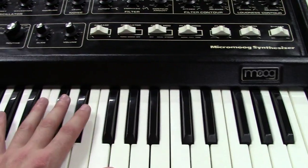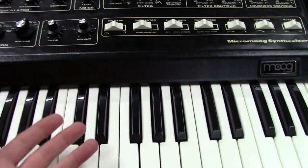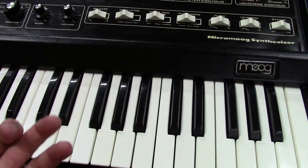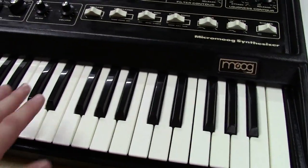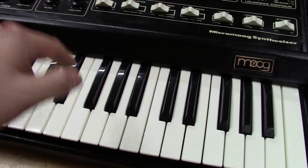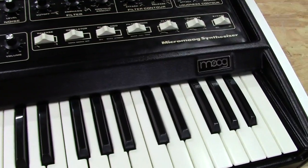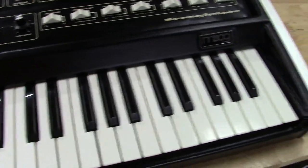And so this one has a later circuit board, where they used a fiberglass circuit board, and it lays vertically underneath the keyboard, and it has integrated circuits making up the resistor network. So it's a resistor package, and there are these chips, so it saves a lot of room. But also your J wires mount differently. They mount to the circuit board and stick out from underneath, which gives you more of an angle when you push, so it's under less stress. And it doesn't have the sliding motion as much as the earlier styles inside the actuator arm. So just a little bit of history there.